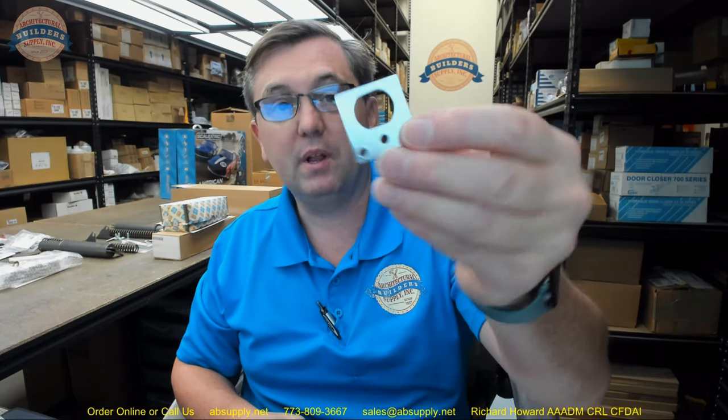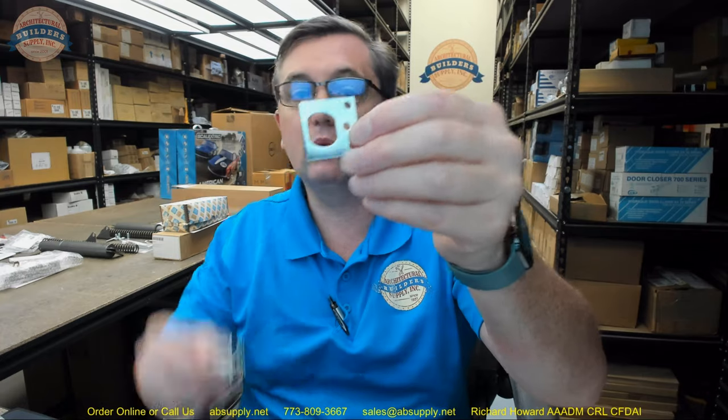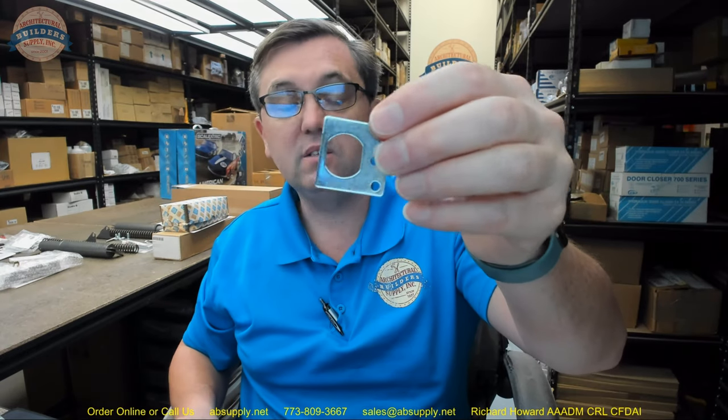It is going to have this anti-rotation mounting plate that is installed — it will go onto the lock itself. They literally call this the anti-rotation plate; it will fit down onto the lock body. The three included screws will be mounted to keep the key from being able to force the cylinder to rotate inside the opening. That is called a double-D preparation, very typical and common in steel filing cabinets. There are tools that locksmith manufacturers make — a steel punch for a double-D prep — where you tighten a die through the door or cabinet face to give you that double-D prep for mounting your hardware.